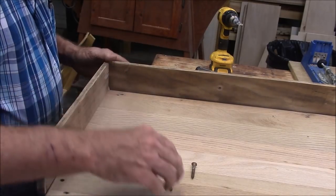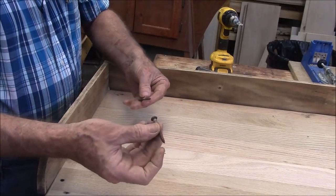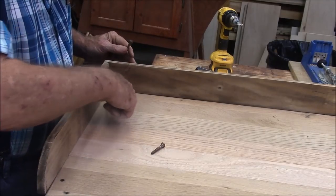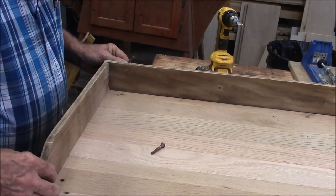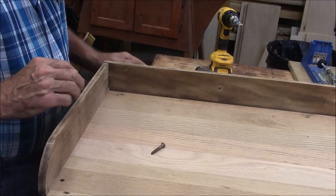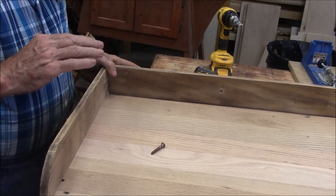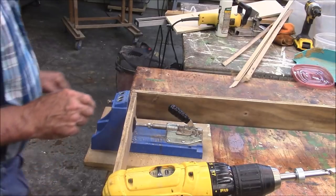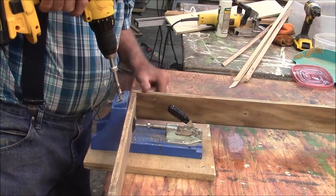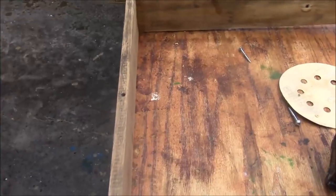Fix and re-install this little fence around the desk. The original way it was attached was with these big old-timey honking screws, and you can see what it did to the wood — it pretty much killed the wood and also split these backs, trying to hit that small target from underneath. So I'm going to put pocket holes in this little fence and attach it with pocket screws. I'm going to put two pocket holes on the sides and three along the back. Another issue with those big screws: they only had one big screw in the side, one right in the center, and one down at the other end.